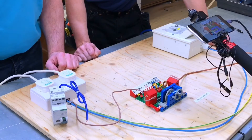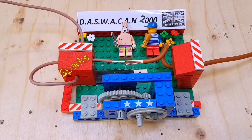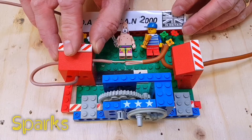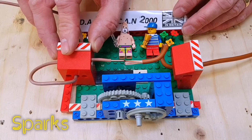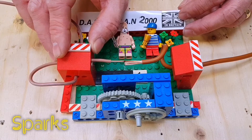Our fault detection device by Crabtree is energized. The consumer unit is turned on and we've got no load, so we're creating absolutely no arcs and no current is being drawn at the moment. We're going to introduce one heater first of all at two kilowatts. With a little bit of technical adjustment, it's very hard to sustain an arc even with this precision apparatus, but we can see some arc events happening - very brief ones. There's some smoke coming off as well.